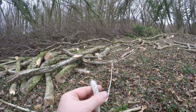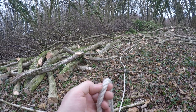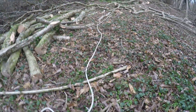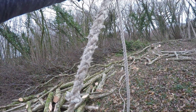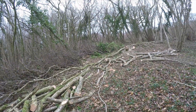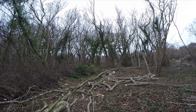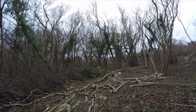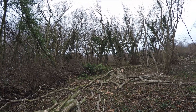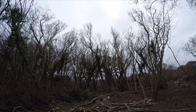So this rope, which would no way pass a LOLER test — half of it came off the beach at Castle Cove down on Portland and half of it was in 12 metres of water on the artificial reef in Poole Bay. It's got a splice in the middle which reduces the strength of the rope, but the maximum I can pull is one old geezer's weight. I'm 5 foot 8 and I weigh about 12 and a half stone. If I really go at it, maybe 120 pounds, then I'm running out of traction. But three-to-one, multiply that by three — that's 360 pounds. But I was pulling a lot less than that to pull it over.